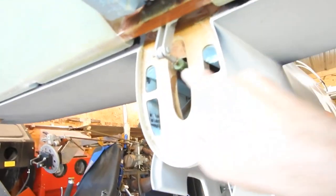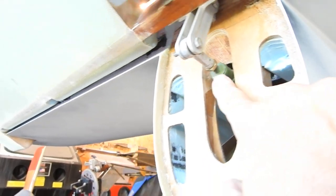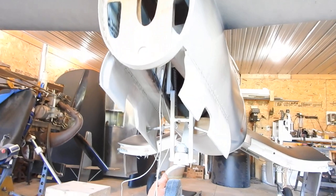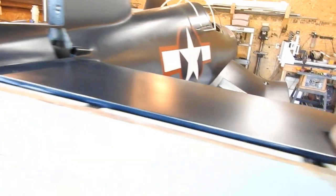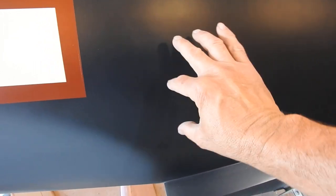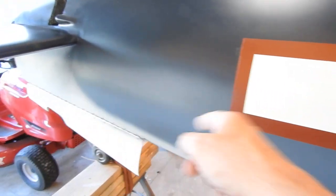The next biggest chore was that all these push rods and rod ends have safety jam nuts on them. Every one of those jam nuts had to be tightened — they were all loose. The ones up inside are an extreme pain to get to. Good thing I've got long arms. We're talking one control is clear into here, and the other one is behind the seat. There are three rods from the stick back to a bell crank that pivots on three points. When you push the stick forward, this rod goes back, and the bell crank pulls the bottom one, which comes back and hooks onto an idler, and then the third one goes back. None of those were tight.